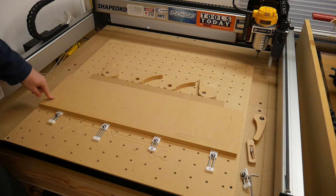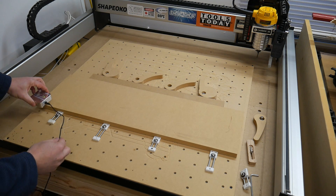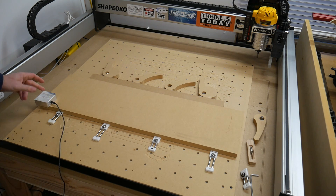We're ready to take the Z and put it over here. If you have the probe, go ahead and get the probe out, and we'll move it right to the front corner — we're ready to zero our front corner. If you don't have the probe, you're going to use a piece of paper and do the same thing. Bottom left is the way the file is set up, and we'll start jogging it over here.